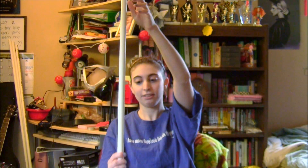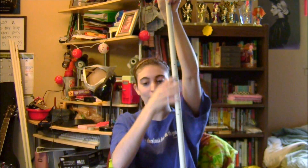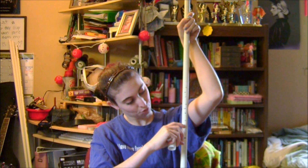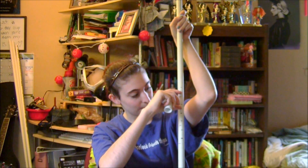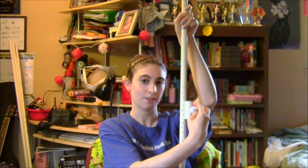For the PVC part, this is a five foot length with measurements on the bottom — it looks really odd but they make sense. The bottom line is 12 inches from the bottom of the pipe — it's going to be a tripod. There are three spaces and each one is the size of one of these T connectors for the different angles the feet are going to go.